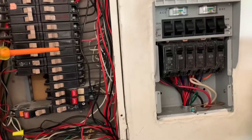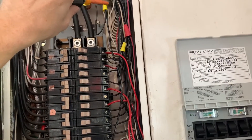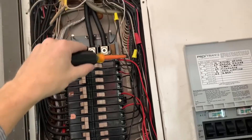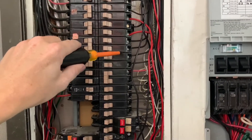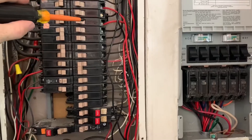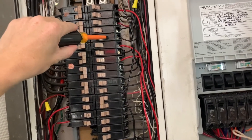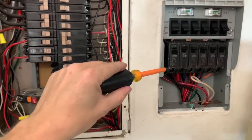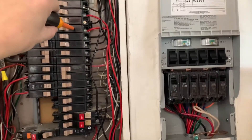I've just wired up the wires from the transfer switch to the main breaker panel. Normally you have a white wire connected to the breaker panel box in the back, and then you have either black or red wires connected one to each breaker right here. You're basically bypassing that — you're inserting the transfer switch in between that wiring circuit. So instead of your black wire coming down here and connecting right into the circuit breaker, you're actually going to connect it to the black wire coming from the transfer switch, and then the red wire feeding back gets connected to the circuit breaker for that particular circuit.